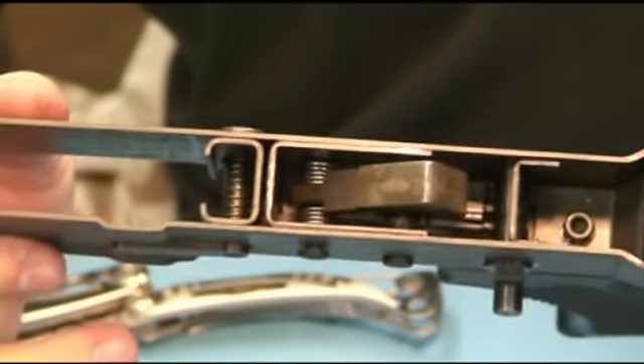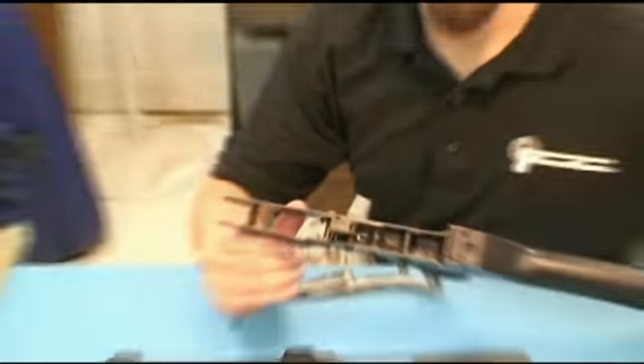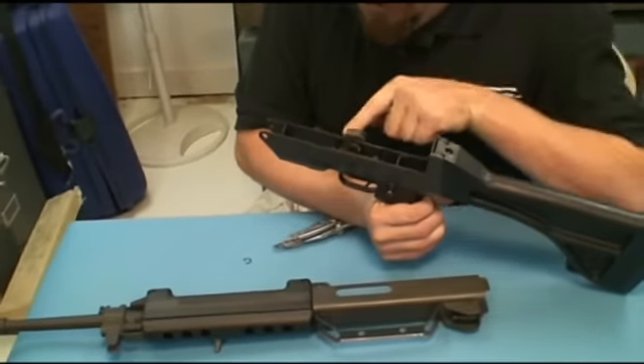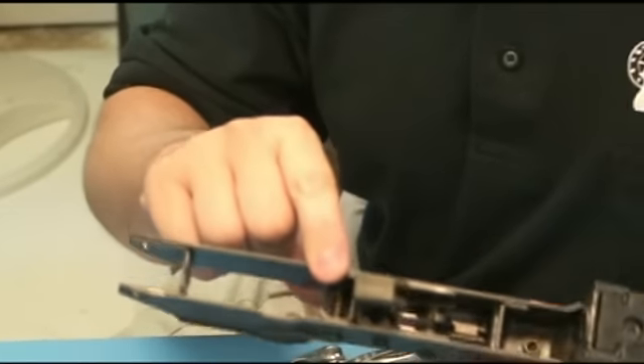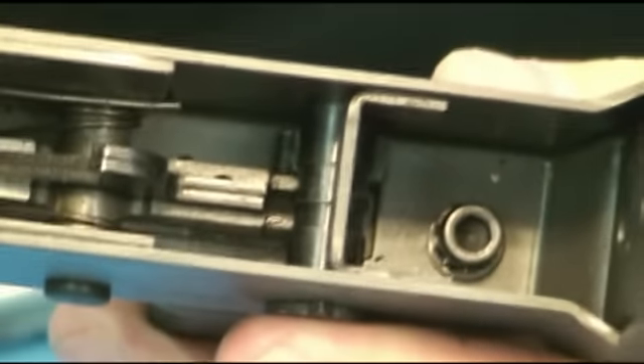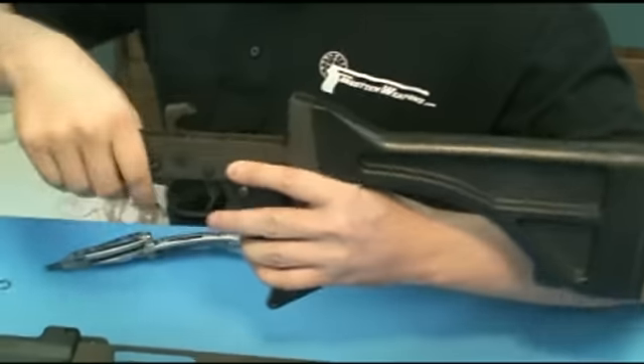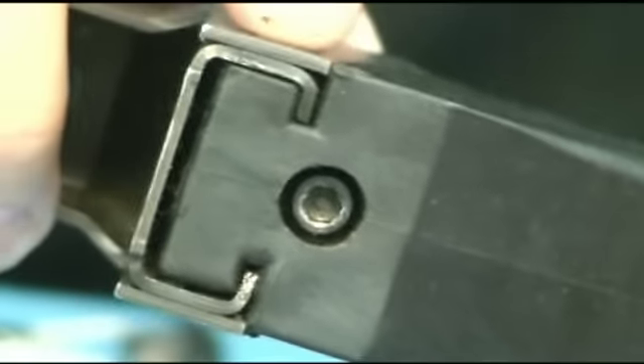You can see we have a very simple lower receiver here. The fire control parts are very similar to the AR-15 in design — a bunch of stamped components in there, and the hammer is investment cast. You can see the dividers here that do things like position the magazine release, act as a front stop for the magazine. These are all simply U-shaped pieces of folded metal that are spot welded in place, which makes for very simple manufacturing. The buttstock has its own stamped dovetail, so exchanging or developing different buttstocks is very easy — just something that slides in with one screw.